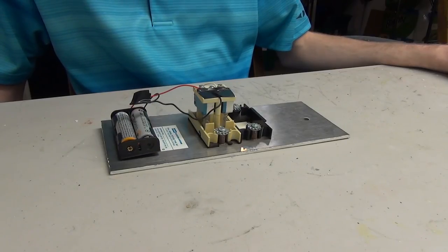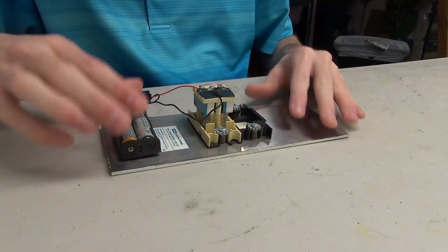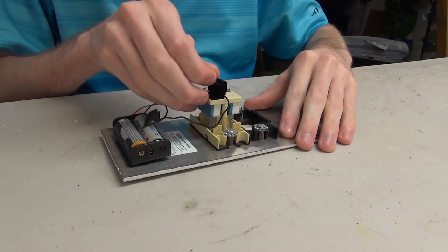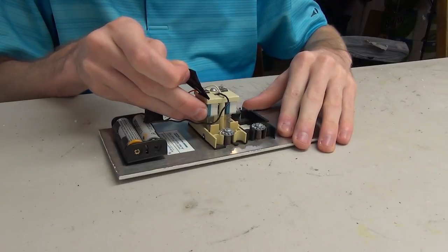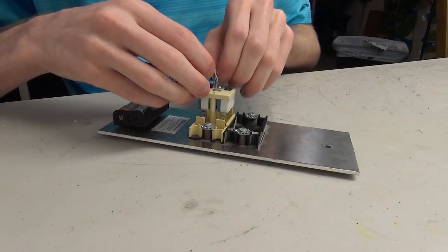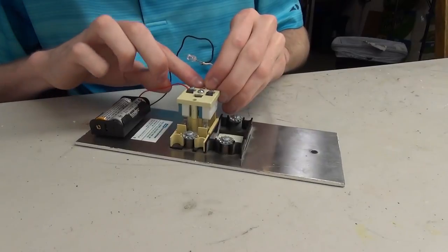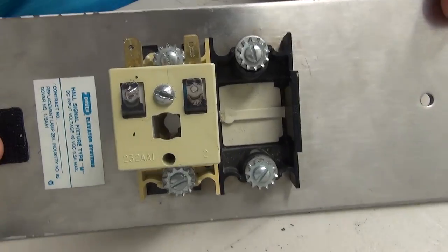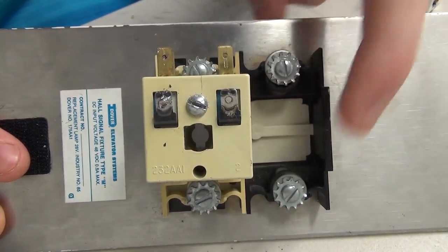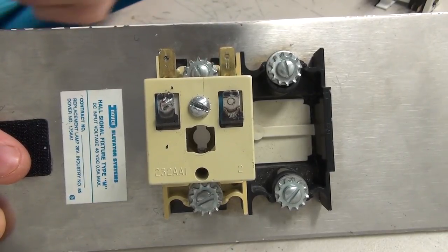The first thing I want to do is take this old button off. I've actually soldered to this pin here because I didn't have the wires, so I'm going to have to unsolder this first. I also put a piece of electrical tape to hold my LED in place, so I'll pull that off and pull the LED out. Once I pull the LED out I can press down and it lights up. Now I need to unsolder these wires from the pins. Now that I've pulled the battery box off, we're going to go ahead and switch out this button. You can see on the side there are two screws — that's all that's holding this button down. You just take the screws off and the button comes right out.